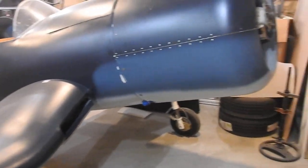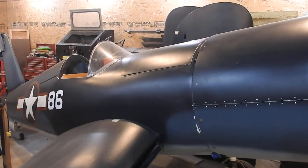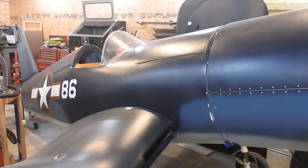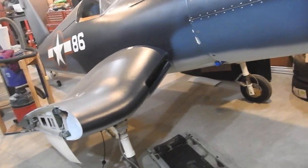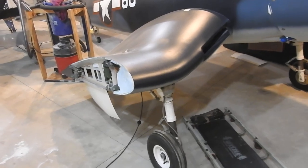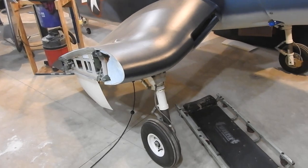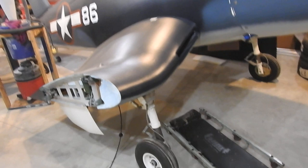I still need to pull the cowling and button up a few things in there, get the fuel tank off, get the gauge hooked back up, and get the paint touched up in spots. Then I'll get working on the canopy again as soon as the gear doors are done. I'm going to need to push the plane back so I can get the cherry picker in to lift the airplane up for the gear swing. Everything is pre-fitted now — it's just a matter of swinging the gear, getting the cam into position, marking it, drilling it, setting it, and hopefully forgetting it.